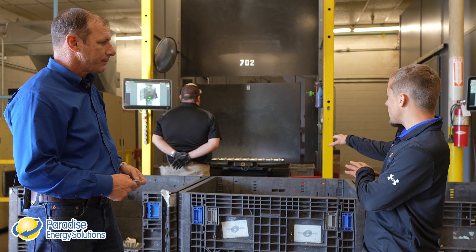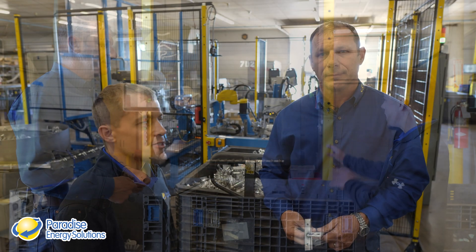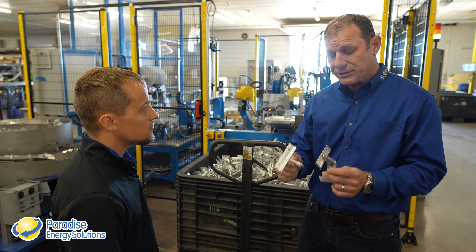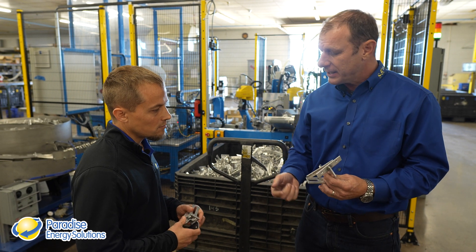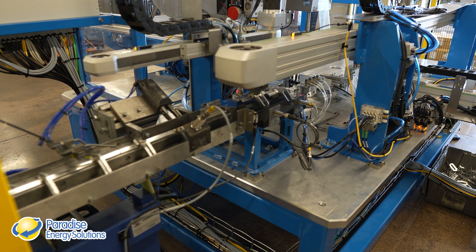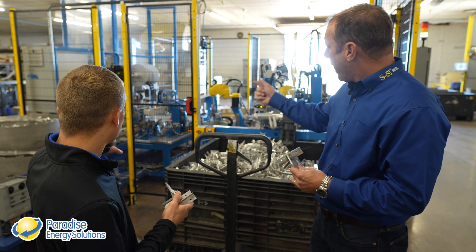There are 20 parts on each fixture — 20 parts on this side and 20 on the other side. Next, it takes two of these welded components along with the mounting bracket, a carriage bolt, and a nut, and assembles them into the final product. As long as you keep feeding products into the machine, it keeps outputting finished assemblies at the end with no intervention — the bolt feeders put all the components in the correct position through the automation itself.